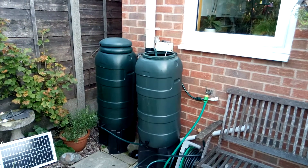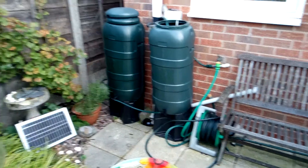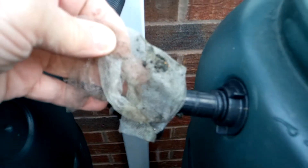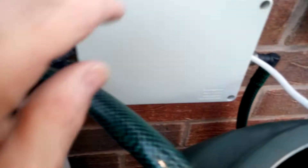Here's a cheap and simple way of harvesting rainwater to feed your washing machine. I've got two rainwater tubs fed from two roofs, using a standard takeoff feed straight into a little filter that gathers all the lumps. Then I get the water out using a Whale pump — the kind usually used for drinking water in a caravan — on a 12-volt feed.